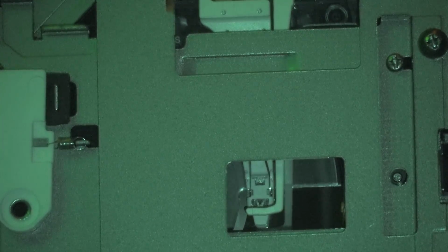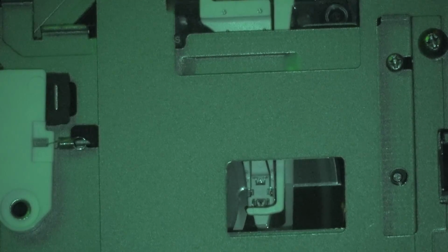Once the disc is recorded, I eject the disc, it'll go back to the beginning, it'll rewrite the table of contents. And this is how the disc got erased. That other recorder that I was trying to record on, obviously it's not making a recording, which we found when I tried to play it back and it went to the area where the music was. I could see the counter was trying to count, but there was nothing there because no information was recorded by the recording head.